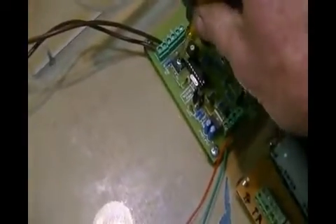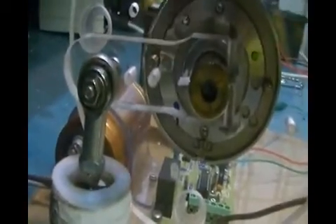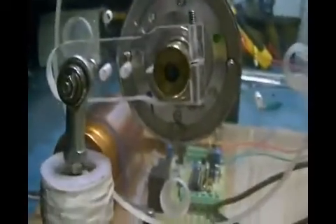It's a very versatile setup — we just pulse it for the amount of torque we need. More torque, we pulse it quicker. There is also another torque setting: on the crank you'll see there are three holes, plus one more around the back. Without changing motor sizes, if we need a stronger motor we simply move the conrod to the outside hole. If we want more revs and don't need as much horsepower, we move it to the inside hole.